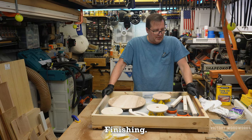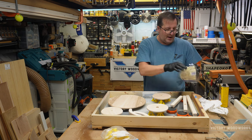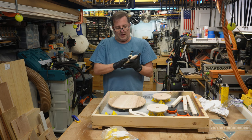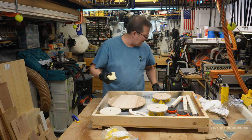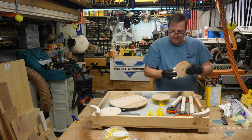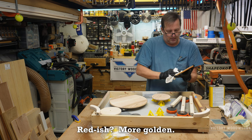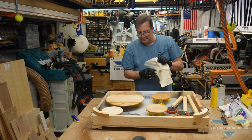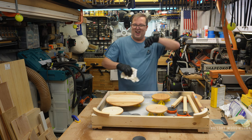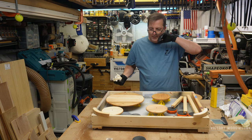The next step is to apply tung oil finish to all of our pieces. But before we do that, just so you know, we sanded it all the way down, then we're going to use this tack cloth — they call it a tack cloth because it's very tacky — to get any wood dust that may still be on here off. Because this is maple, it's going to be very light. You can see it's taken on a slightly whitish reddish color. So we have coat one done. I'm going to hang this or put it in my little box — I don't want this to spontaneously catch fire and torch the place. We'll be back a little while, wipe it off, and then see if we need another coat.